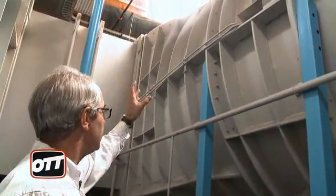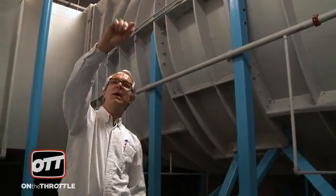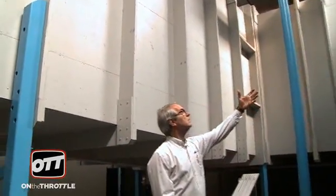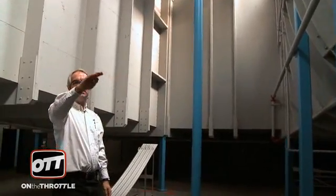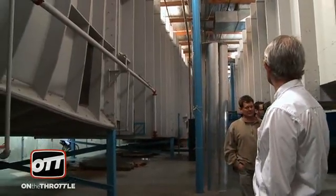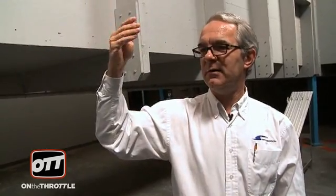This is the fan section. There's a 500 horsepower DC motor in there. The air comes from the working section, gradually expands — there's a taper on the section — it turns through turning vanes on the corners, and the fan pumps it through. It carries on expanding slowly to go through the coolers and the flow straighteners just before the contraction section. What looks like just a piece of mesh actually evens out the pressure distribution across the tunnel. And just prior to that, there is a honeycomb flow straightener that sets the flow to be flowing true to the direction of the tunnel.